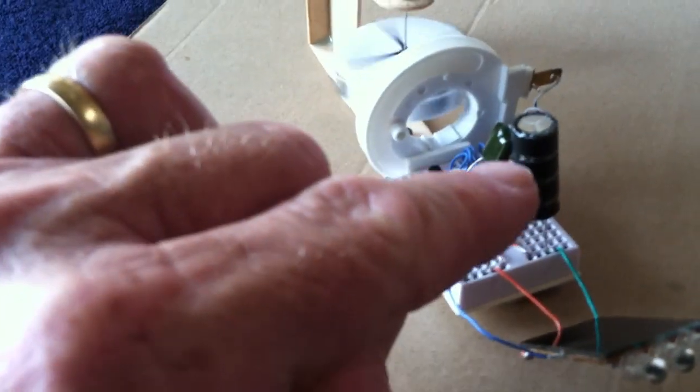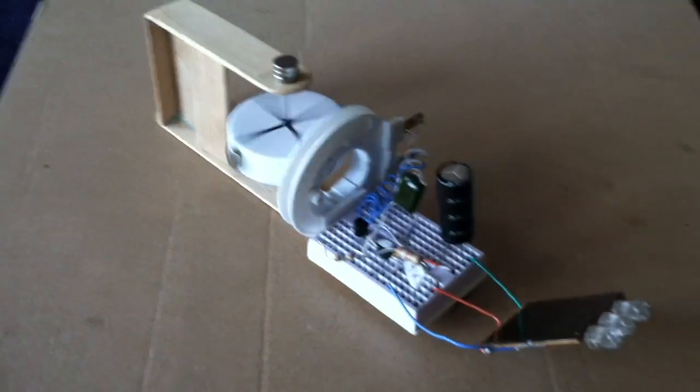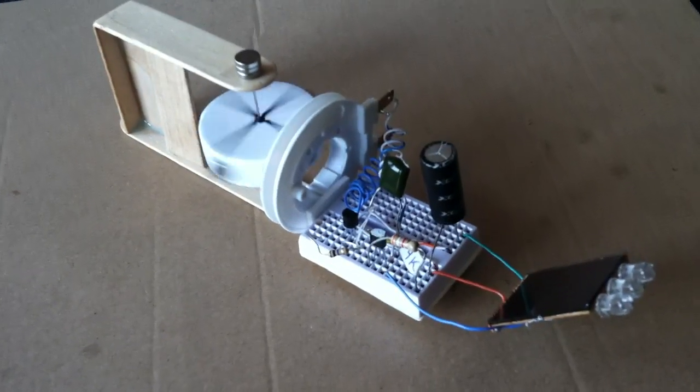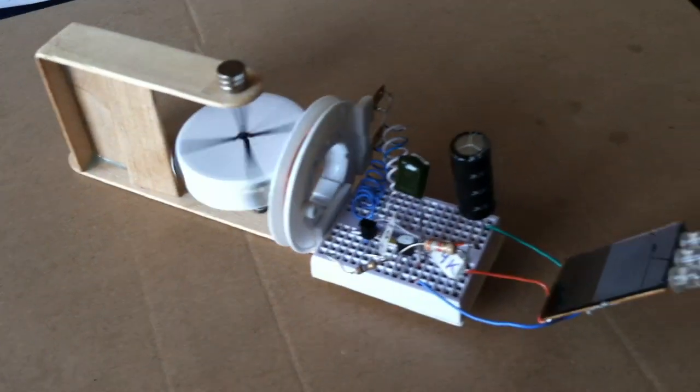You can see this much better in the dark. These LEDs blink to show you that it's firing, and then you've got a button. That's an advantage — being able to see what's in that storage container, be it a super capacitor or a battery. It's kind of like a voltmeter: if you click it on and it's dim, it's low; if it's bright, it's up — plus the speed of the rotor, of course.